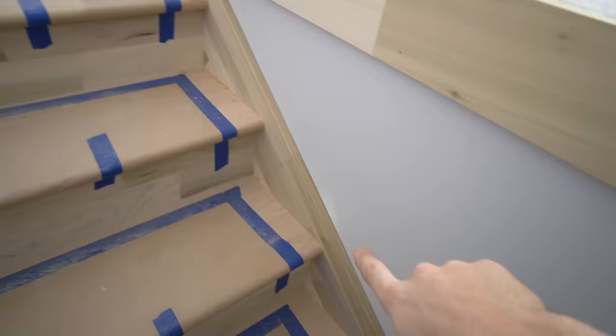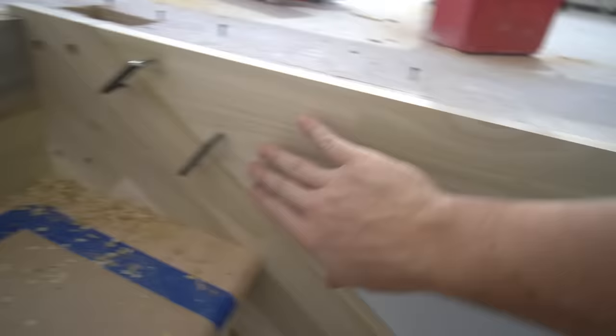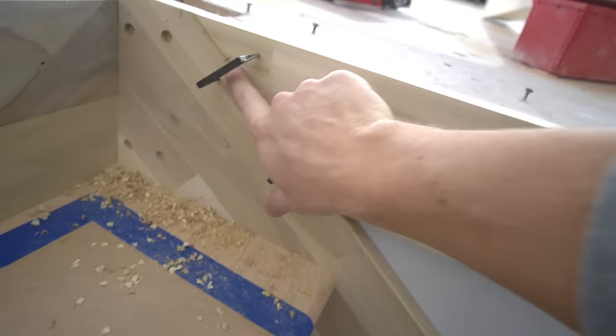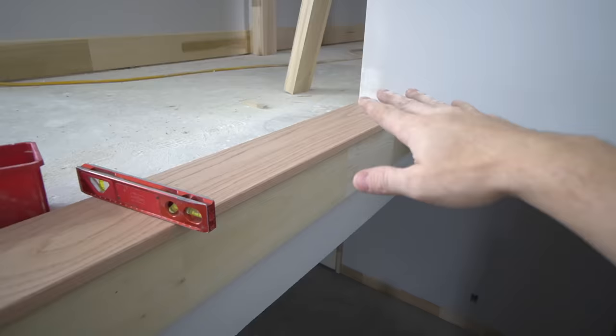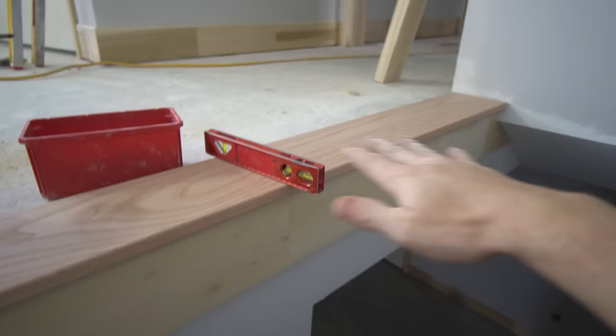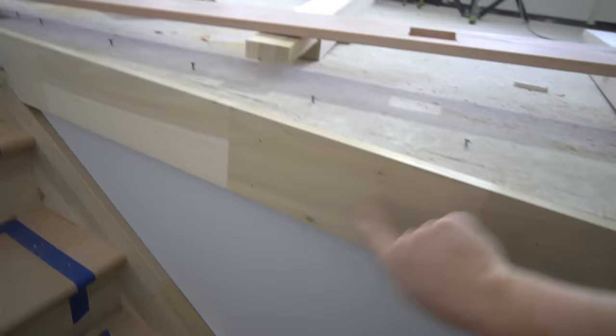Usually I have a three-quarter inch thick one-by-10 or one-by-12 skirt board and I like to use a one-by for this piece also, then plane it out flush right here. I've got two number 10 biscuits with glue and then pinch dogs to draw that together. After that's dry we'll pull those pinch dogs out and sand that nice and flat. Now this board laying on the flat I call a shoe rail board, and we want to get that thing nice and flat shimmed across here — a lot of times the floor is very inconsistent.